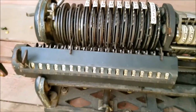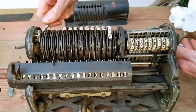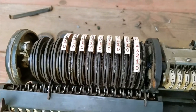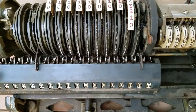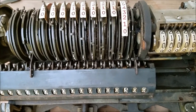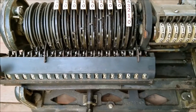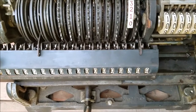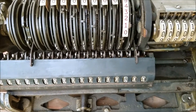It has a cam so you can't turn it backwards — so if I hold that and turn it backwards, now watch this gear pop up here. See it pop up there — now it's going to go down, it's going to hit 3 teeth, and then fall back in. So it only adds 3 to the accumulator. If I set this on 5, it's going to pop up and add 5 teeth, and then fall back down and continue.